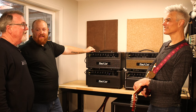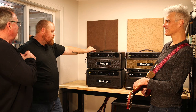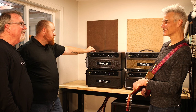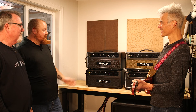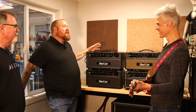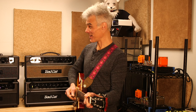We also changed up our testing procedures quite a bit. We basically just abuse them — they go on a vibration table that shakes the hell out of them, then we burn them in for 24 hours. Peter built a test jig that records signal going through them onto a DAW so we can look back through it and see if there are any anomalies. When play-tested, they're picked up and dropped on the bench a handful of times, everything turned all the way up. The goal is to reasonably try to make them break.